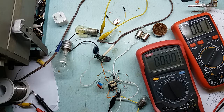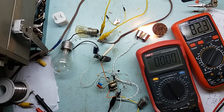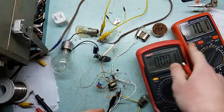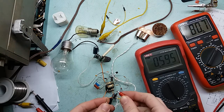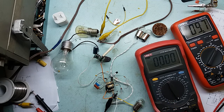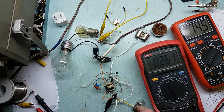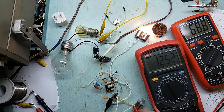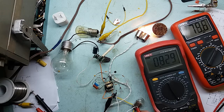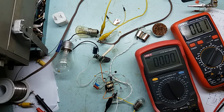Alright, so you saw everything you need. You saw the schematic, but I didn't show you the no load consumption, did I? Here's the load. I'm gonna switch it off, and as you can see, about 1 watt. And I connect it. It's still powered. And I can short circuit it, look at the amperage, and look at the consumption. 1.5 amps and 2.6 watts. See? I can connect the load and I can short it out. See, it's very nice. Right now it is limited to about 5 watts and it cannot supply more.